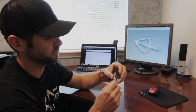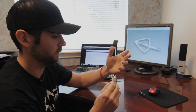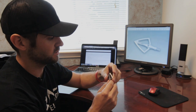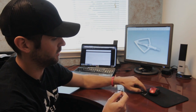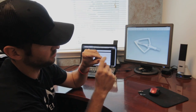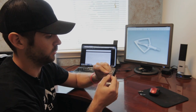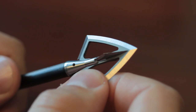Second on the list: it had to be extremely strong and durable, and the only way to do that was to use 100% steel — absolutely no aluminum. There are a lot of design details that may not be obvious at first glance. Number one is the S30V steel that the main blade is made from — it's four times as strong as other steels in impact resistance tests. Number two, the penetrator blade actually slides into the main ferrule and locks into place by wrapping over the top of it, creating two bridges so the tip can't be bent. I've done a lot of tests shooting this into steel and it won't break. The main blade, ferrule, and penetrator blade are integrated so that when you slide all three together and lock the screw down, it basically becomes one solid head.